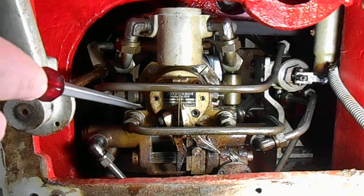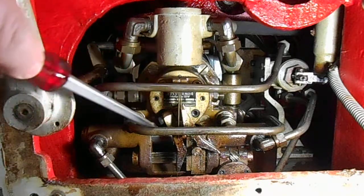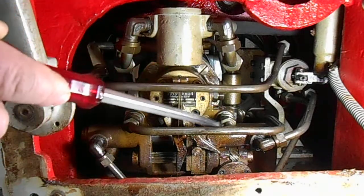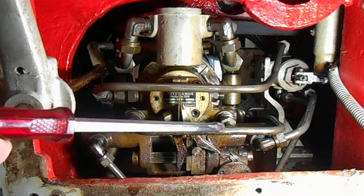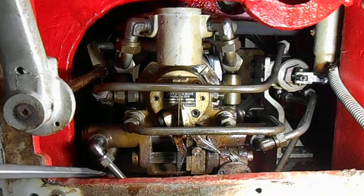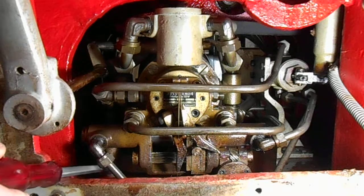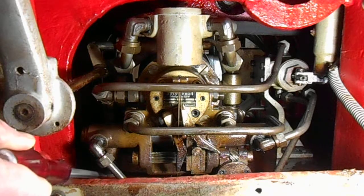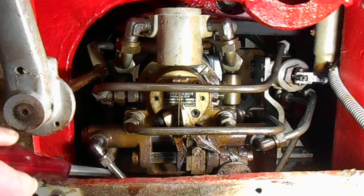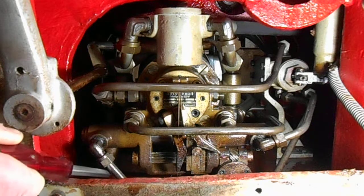Once that's done, there's — I'm pretty sure — a pair of valves here and here to the outlet. That's the outlet line and it just simply goes back into the tank. That's the first stage of the pump. The dump valve for how soft the table stops and returns — it's backed right off at the moment and still making that noise.